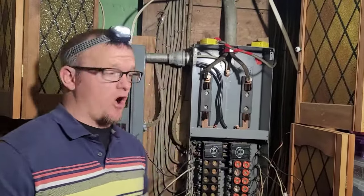So now we've disconnected all of the wires, got them all either disconnected or loose. What we're going to do now is straighten all these wires, get them nice and straight and paired together — if there is a ground, you're going to need the hot, neutral, and ground of whatever pair. We're going to take these lock rings right here and knock them off — lefty loosey — and you're going to knock all your lock rings off. Then you'll be able to pull the entire assembly out of the side of the panel.